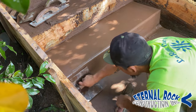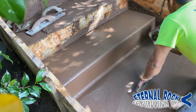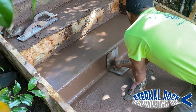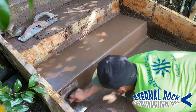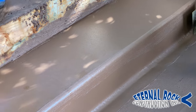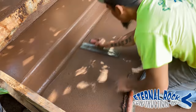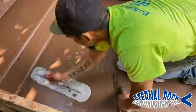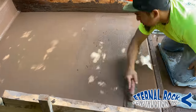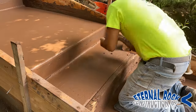Then he has that little elbow tool — that's what they call it. It's used for the bottom interior edge of each step. What that does is it kind of presses in that concrete, compacts it nice and well in that area, and gives you a really nice smooth interior edge. Once he ran that tool, you get a nice beautiful uniform interior edge. Then from there, he's just going to float it, and he has his trowel right there. The trowel also helps him out. Once you float everything, then at the very end you run your trowel, and your trowel is going to give you that nice smooth finish. You just fill in the low spots, run all those tools along all of the surfaces, the edges, and everything. Then once you trowel it at the end, that's pretty much the process of how we finish the steps.